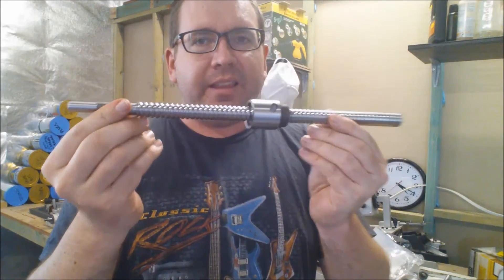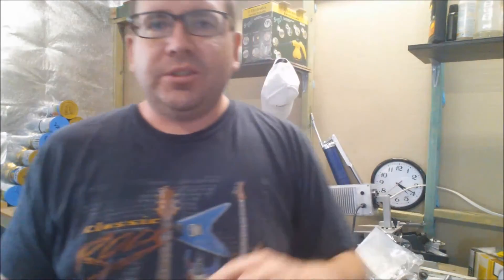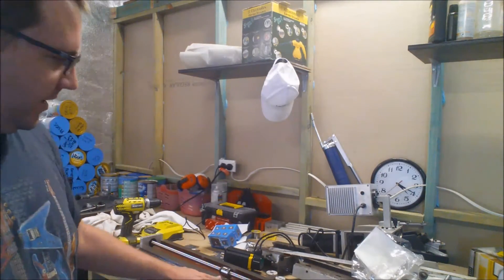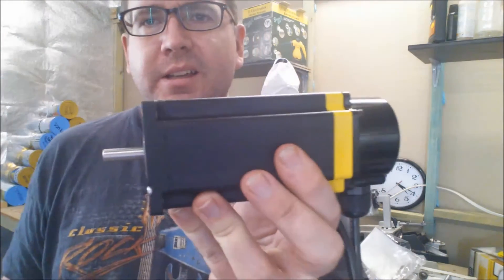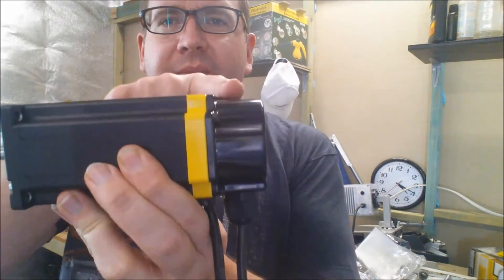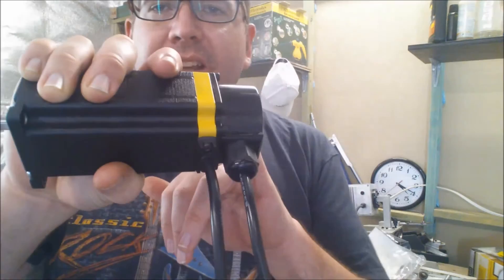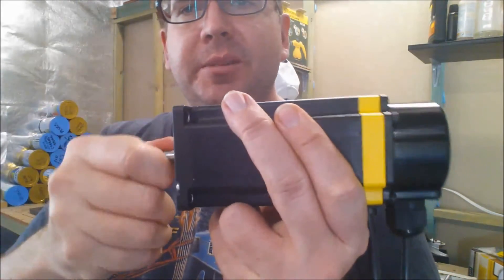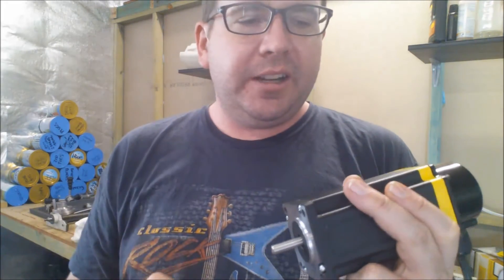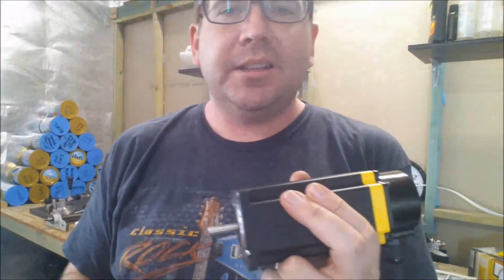This is the shorter one and that's for traversing front and back. I've also got the one on the table — I'll swing that around in a second and show you. But I'll just quickly step over to the motors. That's a NEMA 23, a 570 ounce motor. Two cables coming off it — one's for the encoder and the other's for the actual stepper motor itself. So they're 570 ounce motors which I'm going to be using for moving the table around, and then I've got a NEMA 34 version as well which is going on the top and will lift the Z-axis up and down.